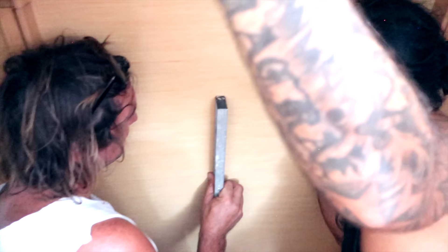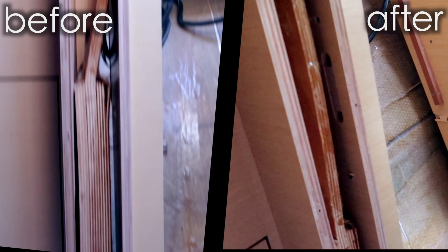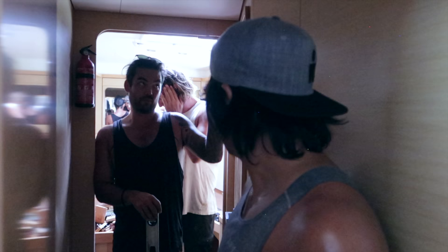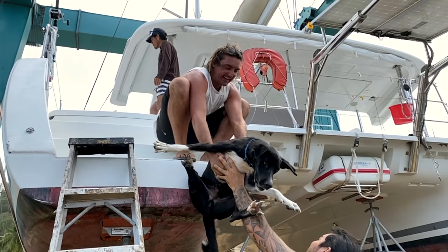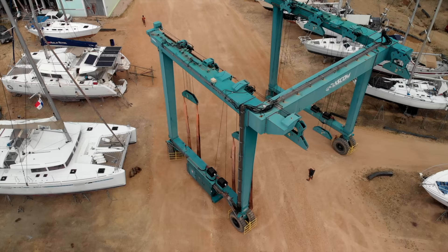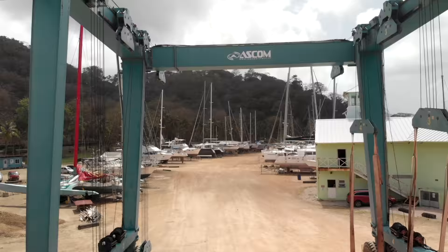These interior walls came perfectly plumb from the factory so it's a really good place to check alignment. Our starboard side was still five mils out but it straightened out after just a few days of the boat stretching. The bulkheads improved quite a bit but were still far from perfect — not a big deal since they're gonna be completely rebuilt anyway. What's important is that we got the hulls almost perfect. Leave the rigging kind of slack and then drop this side down a little bit. Just like that our baby was straight again. It was such an amazing feeling — as I walked through the boat I could feel the solidness was back. And like Jamie said, now we just gotta make it stay. I'll be doing some serious demolition in the next video — hit the subscribe button if you want to see me tear apart these cabins and expose every flaw in this boat.